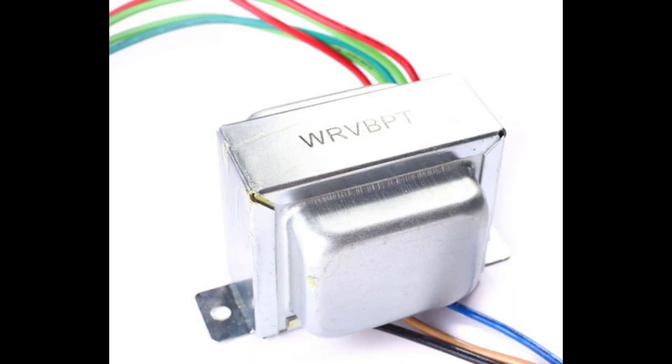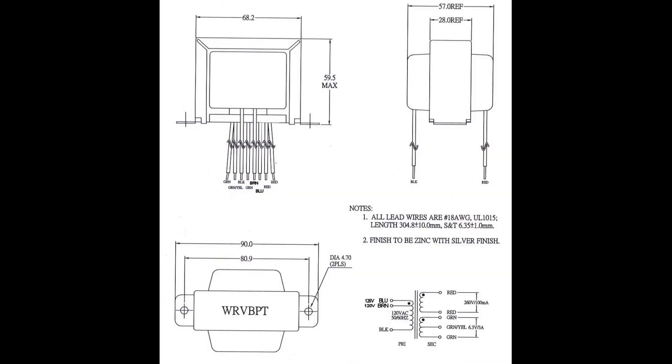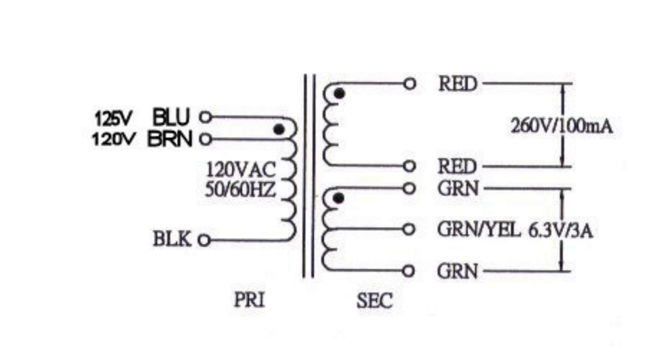Number three. These are one of my favorites — a really versatile little power transformer. Weber Speakers' WRV BPT units power the company's standalone reverb kits, which are basically a single-ended circuit, so they're ideal for a Champ or Vibro Champ style build. If you use the right tube lineup they can even be used for small push-pull amps. They only have a 6.3 volt heater tap, so you're limited to 6 volt tubes or solid state rectification. Given this transformer's price tag of about 36 bucks, that's a fair trade-off.